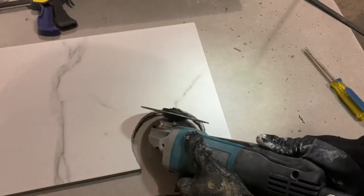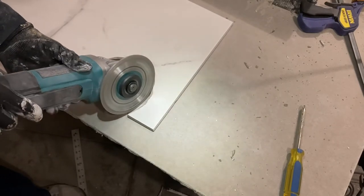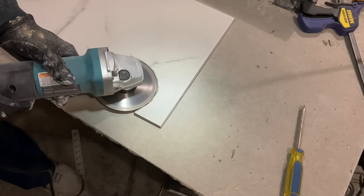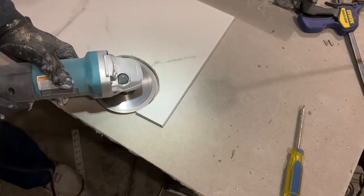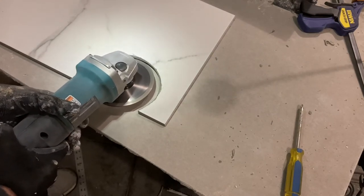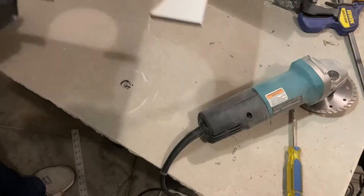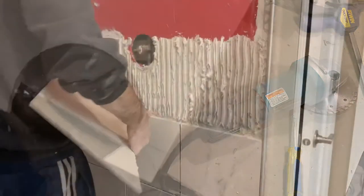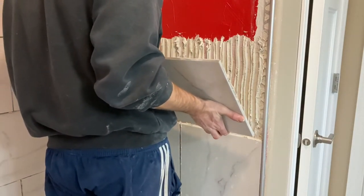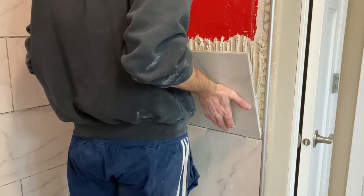Here's where we're at so far. Turn it over and clean it up — you can see it's a pretty good cut but not perfect yet. Here's a trick: if you have a hole similarly sized to this one — about five inches — the blade on my grinder is not too far from that. Just put it right in there and you don't run any risk of damaging the finished surface of your tile. You can just poke around and get it all chiseled out really nicely. I wouldn't say a hundred percent perfect but 95 percent — and it probably just has to be 80 percent honestly, because the escutcheon plate is going to go right over that.